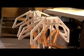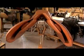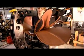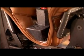This is the SaddleTech device, and they use it to make sure the saddle measures up. It measures it in 4 sections. Now it's onto the tree machine. It adjusts the gullet plate, the piece of rigid steel that sits above the horse's withers. Plastic panels support the saddle, while a hydraulic press bends the plate to fit the measurement.